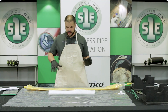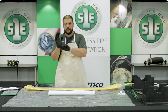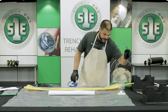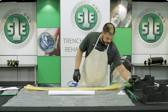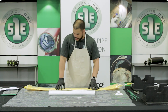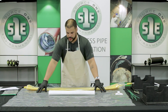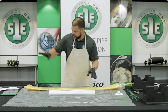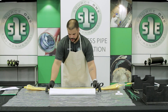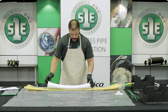Now that we've tested our equipment, we're going to lay out all our materials and make sure that everything is ready to go. Put on an extra set of gloves — so now I have two sets of gloves on. Our green ties are ready to go, wire cutters to cut those, spatula to spread our material, packer has a new protective sleeve, resin and everything's on our work surface. First thing we're going to do is mix our resin — just like our normal pipe patch. We'll wet out one side of the material, flip over, wet out the other side, and then we will slide it onto our packer.